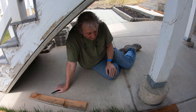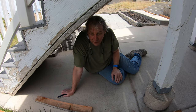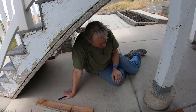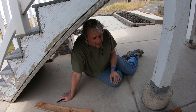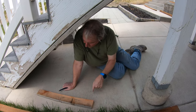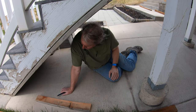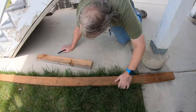Is there? Yeah. Is it straight? Uh-huh. But I just went and checked in our scrap pile and we got a 4x4, but no, it's twisted and split. It's a straight one that we put in the shed, I believe, for this. So if we've got one there, we may use that. And once we've got it, then we'll use the ram set to drive the nails down into the concrete with the foam underneath and all that stuff to get this nice and sealed up. So for now, we're cutting angles.